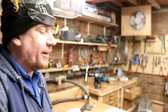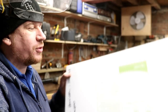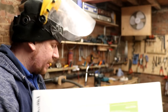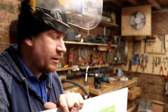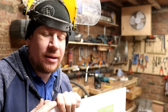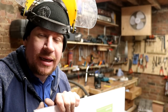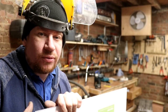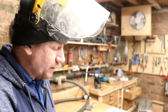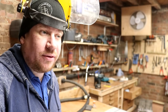or acrylic. It's not polycarbonate, it's acrylic sheet. This is 8mm thick acrylic, which I picked up from Trent Plastics in Gainsborough. Stuart fetched it for me today. It's clear, and I'm hoping I can inlay this into the worktop on a rebate or a rabbet, whatever you call it, and that'll sit flush with the tabletop. Then I can just drop the router in and out as required and store the router under the table as well, stowed away. So I'm going to cut this up, cut the table, and we'll see if we can get one to fit the other.